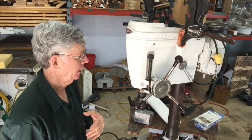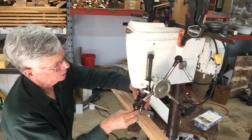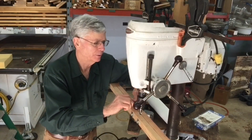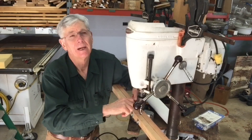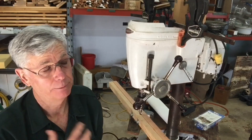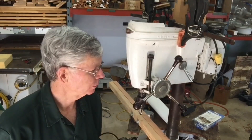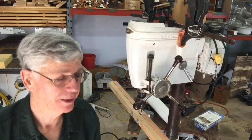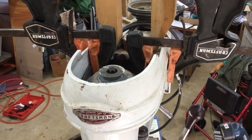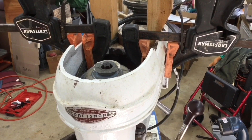One of the remarks was: you absolutely have to go around and tighten all three of the holes on these Jacobs chucks. I was a little surprised — I thought that won't be necessary — but actually I felt movement in all three holes, not so much in the third one but definitely in the second. I've just about finished the setup; this is how the belt is held in place.